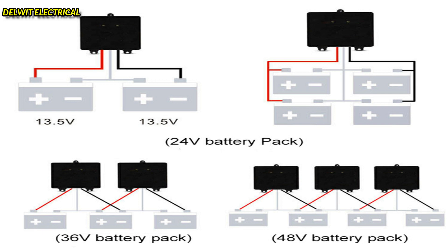Connect two batteries in series, connect the other two batteries in series, then connect the two outputs in parallel. You still use just one battery management system. The red goes to the positive terminal — since the two positives are looped together to the power supply — and the black goes to the last negative terminal. It is advisable to connect the red to the first set's positive and the black to the last negative. The white wire connects to any of the midpoint loop terminals between the series connections. With this done, the battery management system correctly monitors the well-being of the entire system.